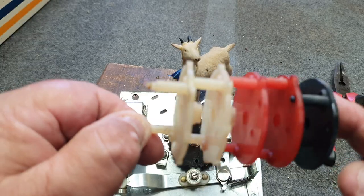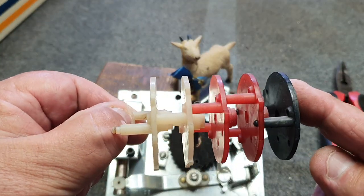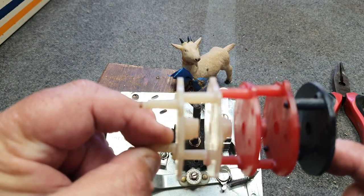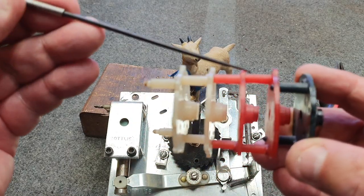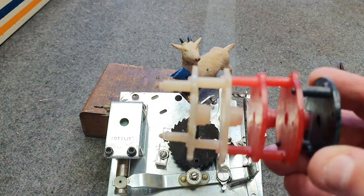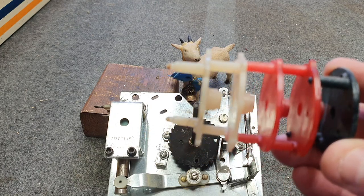Just remember this has got two white and two red cams. The red cams only have one lug on them because it's a two-player game — there's the lug there, and the one there. They use that for the Z1 Z2 reset rather than the actual relays.